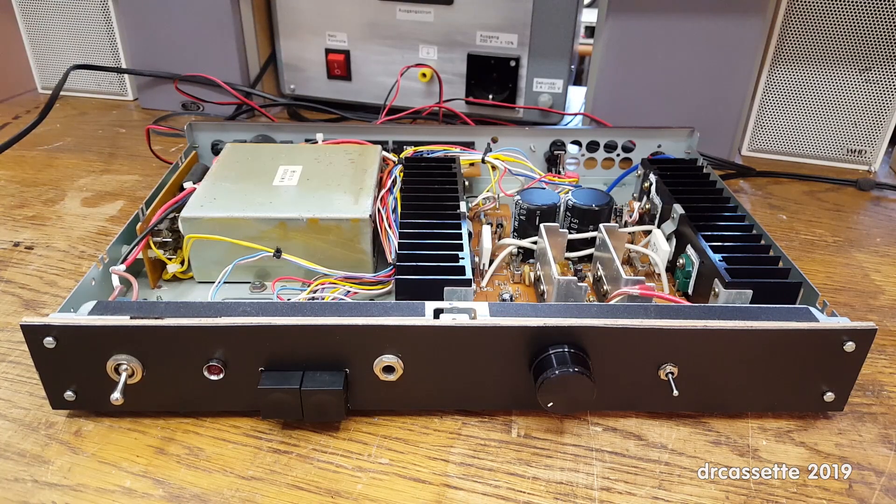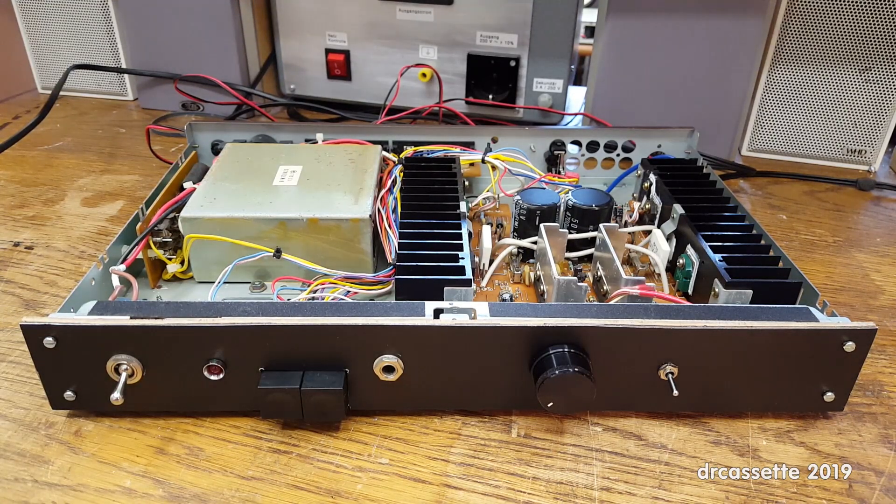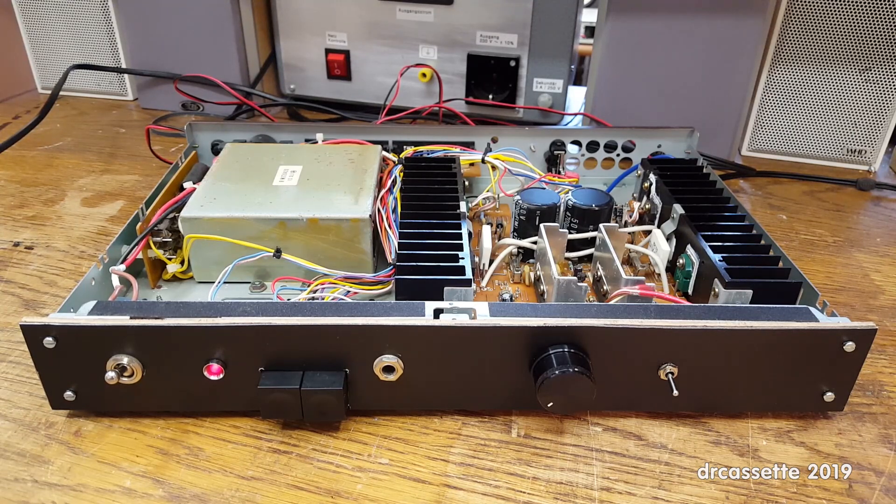Finally, the faceplate is done — it's now black and pretty, because I did manage to find the motivation to make a metal panel to go in front of the hardboard, which is still there as a spacer. The power switch is over here; it has been replaced because the original power switch, although it had a spark suppression capacitor, liked to arc. Here is a power LED hooked up to the 19-volt regulator on the amplifier board via a 1 kilo-ohm resistor. There are the speaker A and speaker B selector switches. Interestingly, when you activate both pairs of speakers, this amplifier puts them in series.